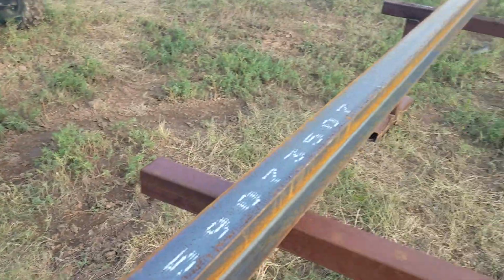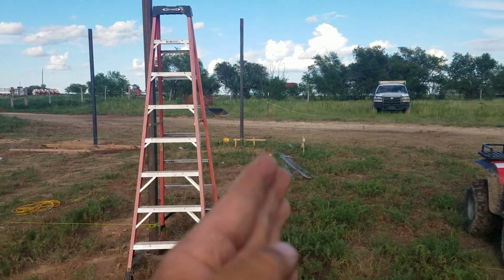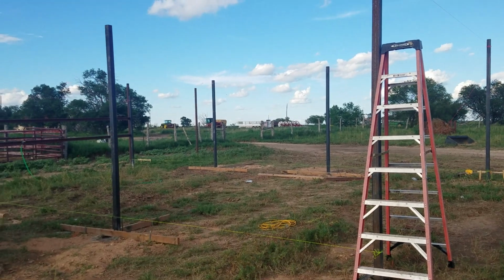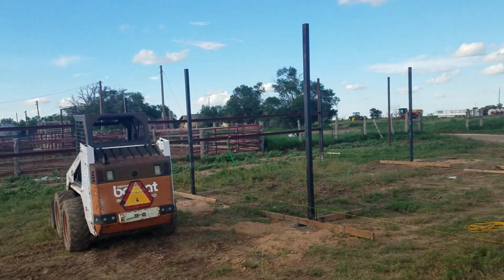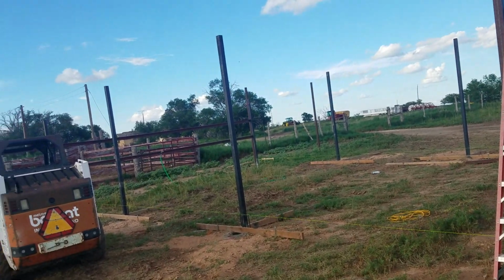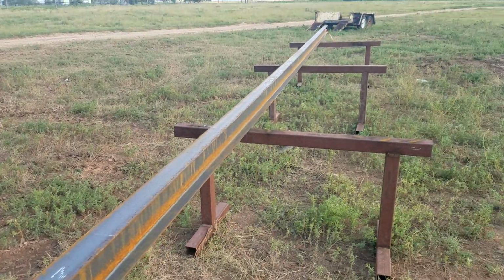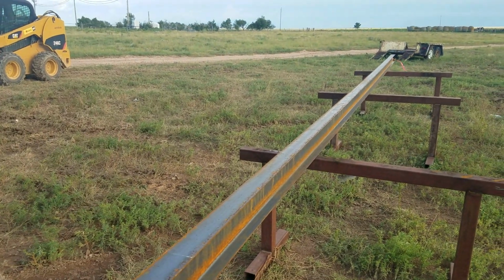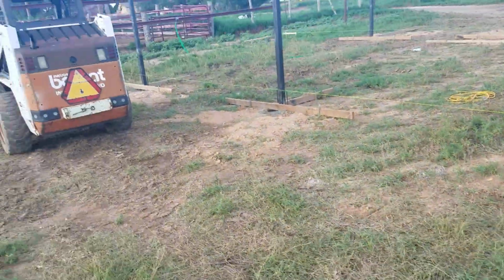So since it's going to be a lean-to, what we're doing with these are 40 feet long. I set my post out to 39 feet, give me just a hair overhang. And I could have done it to 40, but the one other reason why I did that is since this isn't like a formed job, and we're not pouring a pad or laying out stem walls until our tin's actually up. We are going to put a stem wall in, but it's not a foundation stem wall. It's just like a bumper wall. So I set my post in a foot. That way, if by some chance, which we haven't seen any boo-boos anywhere, we did make an accident and we got off, we wouldn't have an issue with our post placements.